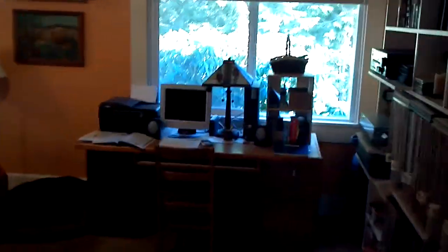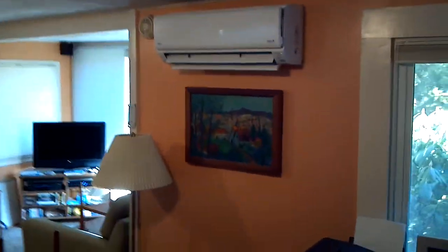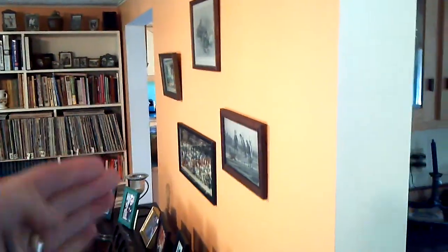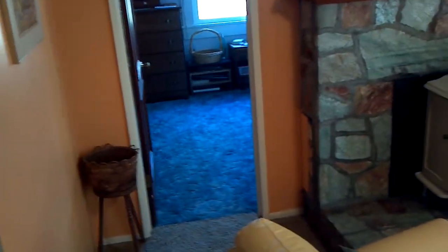Down here you can see spatially — kitchen, etc. This head is level; it's the wall that is not. Placement-wise, we wanted to hit as much space as possible, so having the unit here we're not only getting into the kitchen but also into the dining area. We have a little bit of stack effect in the house, some going up the stairs, but because we have heat upstairs now, that hot-to-cold differential isn't going to be as prevalent, which will reduce some of that.